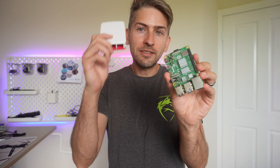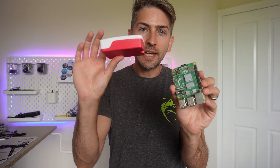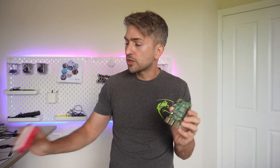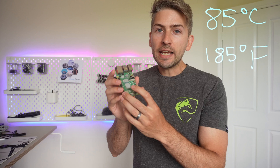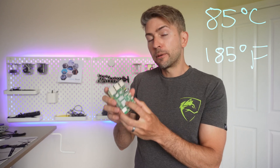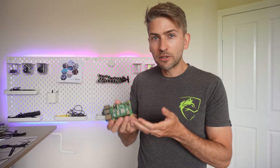This is the Raspberry Pi 4. They are fantastic devices but I have one complaint with mine: it runs hot. I often have this device in the official Raspberry Pi case and I've noticed that the temperatures get up to the max of 85 degrees at times when it's under load. When these chips get up to 85 degrees they throttle their performance to bring the heat back down. I don't like having my performance throttled and I just want it to run a little bit cooler.